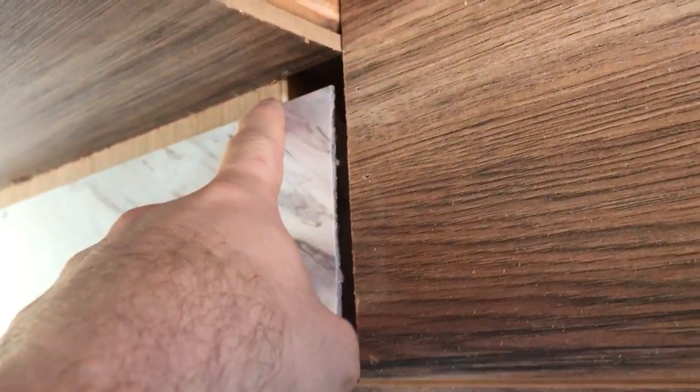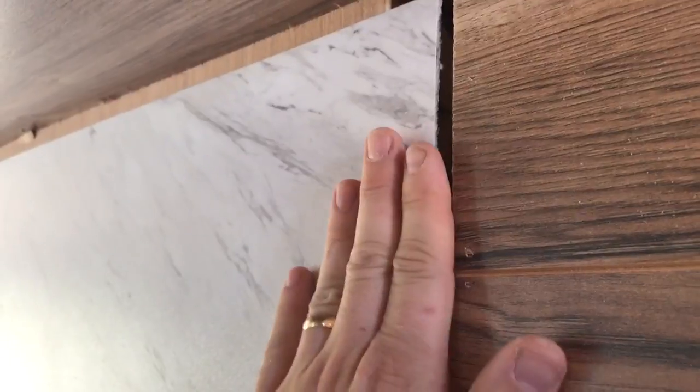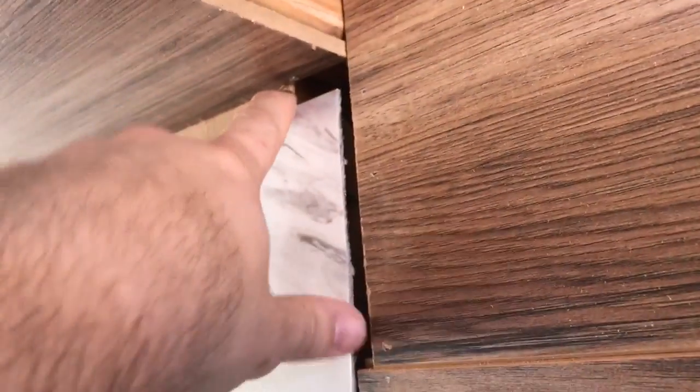So guys, oh, and the seam, what I was getting at is, if you use 1/4 inch ply and then put these tiles up on the wall, anywhere that you do that, if you're using this type of flooring, you will have exact seams together by doing it that way. So keep that in mind. If you're doing transitions in kitchens or bathrooms, with these stick-on tiles that can be grouted, if you do it with that and 1/4 inch ply, then the width of the paneling comes out about exact, and your trim pieces ain't weeble wobble looking. So just some notes on that.